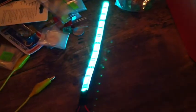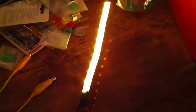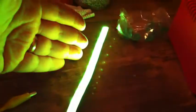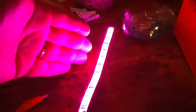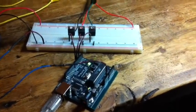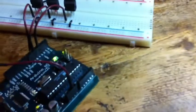The colors are a lot more distinct in real life than they are here. In theory I could power this from 12 volts, but I'm just doing it from 9, so it's not as bright as it could be. You can see the reflection in my hand showing how it's changing color. It's just the simplest possible circuit. I didn't actually use Lady Ada's code — writing the code is really easy. I wrote it slightly differently, but it's the same sort of thing using analogWrite from pins 3, 5, and 6, which are pulse width modulated.